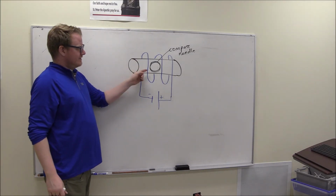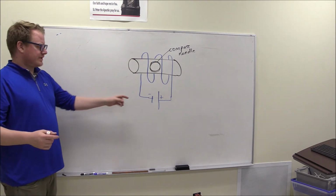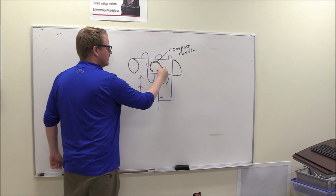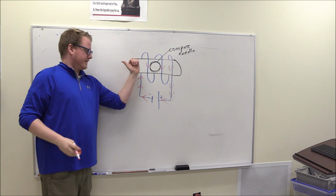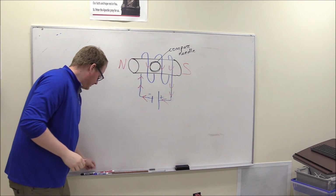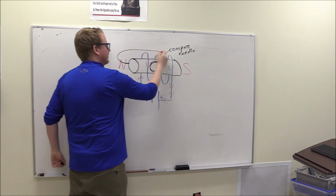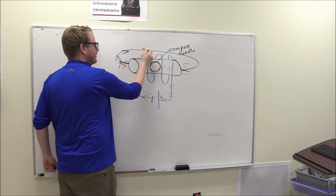What we're saying in this one is inside the solenoid, I put a compass needle. In what direction is the compass needle gonna go? So first thing we gotta use is our second hand rule to figure out, the electrons flow from negative to positive. Down. So it's down all in front. And this was north. So this is the north end, this is the south end. That means when we draw the field lines, I'll use black maybe here, they come from the north and point towards the south. So they're pointing away from the north